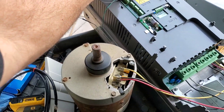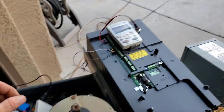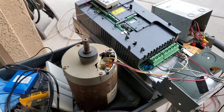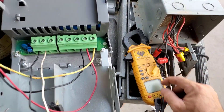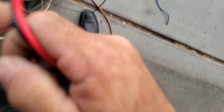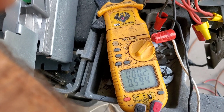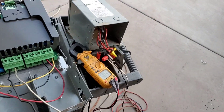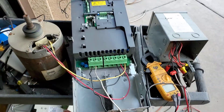Connecting it — it's going to reverse. Nope, does nothing. This drive is good for 460-volt work. Checking the DC bus voltage — the screw was just loose — showing 593 to 594 volts DC when I have 120 volts AC from the house powering all this apparatus.